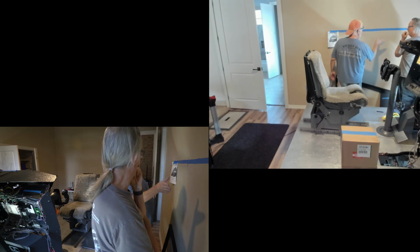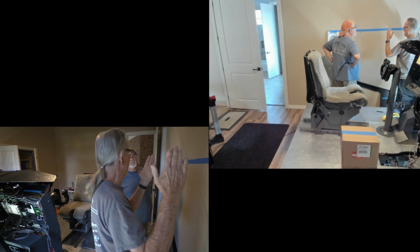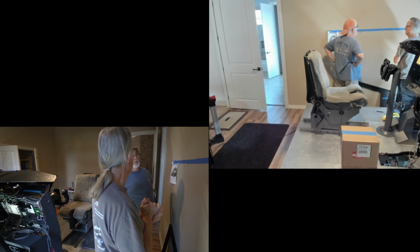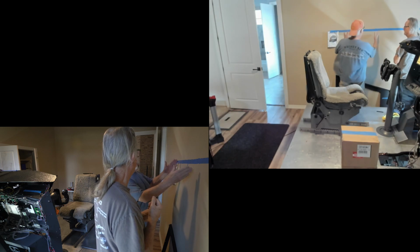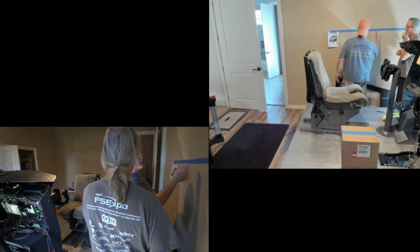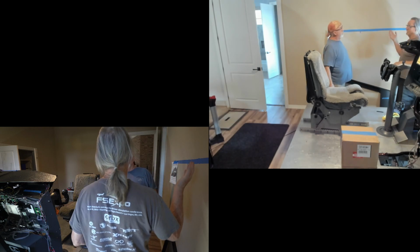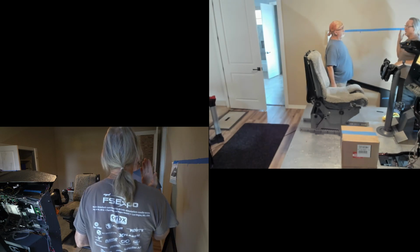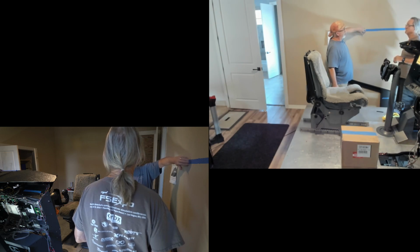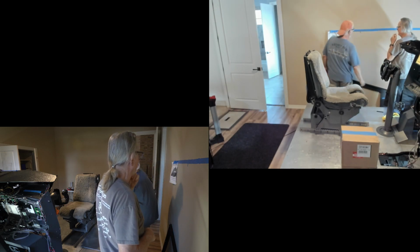Because there should be a plate or something that would keep you from busting right through into the back of the electrical box, and it should mount between the studs. Does that mean they put a plate on top of the stud? No, there shouldn't be. They should have just mounted the box and then drywall. The only time they would put metal on here is if there's water or some sort of wiring. They did put metal over where the air conditioners are, behind the drywall, because there's no box there. The wiring's in the wall, so you want to put metal there so you don't drill into it. That's what they put on the studs in the areas where there's electrical or water running through. It's just those little plates. Okay, so that side's not going to be a problem.